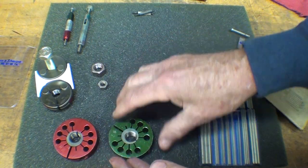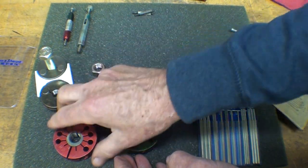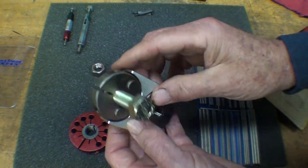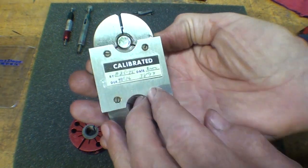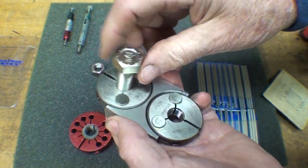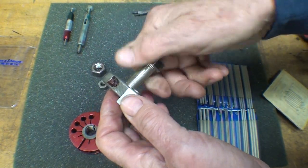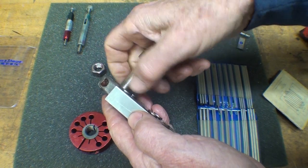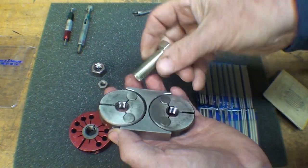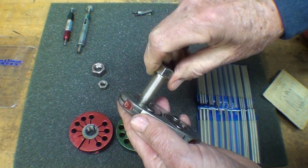You probably are never going to use go and no-go gauges — green means go and red means no-go. Here's another set of them; they're not color coordinated, and I just took these out of the oil. Those were calibrated way back in '75 but hadn't been out of the protective wax since. This is a 1/2-13, and you can see that the 1/2-13 thread turns freely in there. On the no-go side, it does not start at all — so it's no-go.